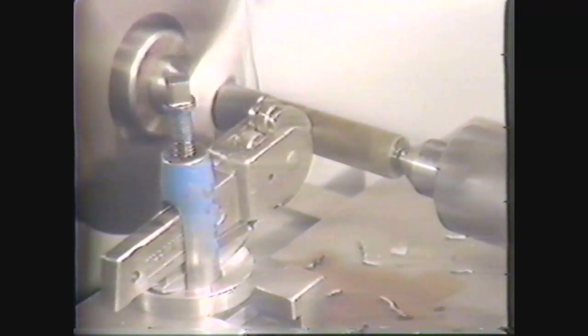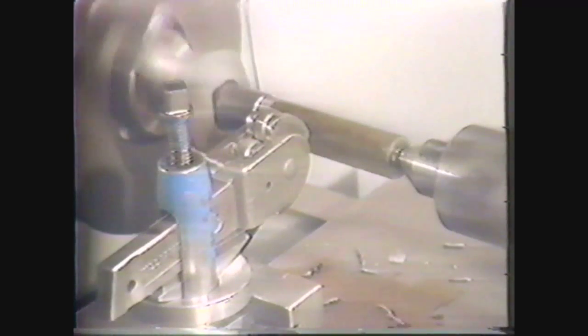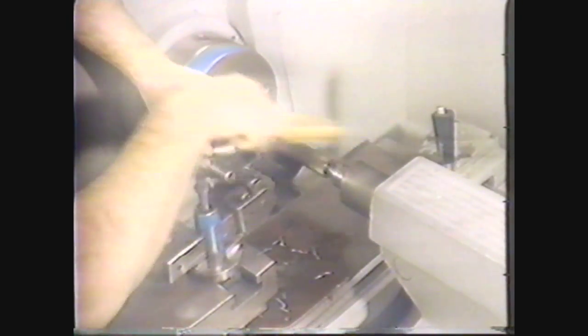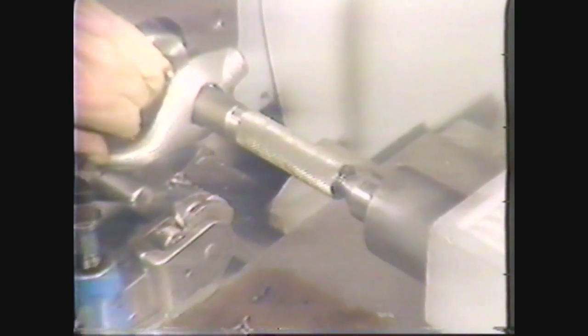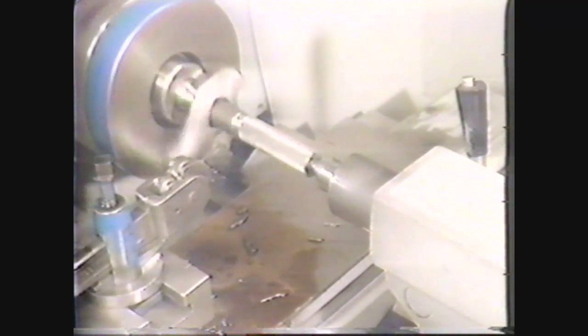At this point, you disengage the clutch to stop the workpiece, and then clean the impressions with a brush. The diamond-shaped knurls should have fairly sharp points across the entire surface. Here you see how a proper diamond-shaped knurl should look. When the knurling is completed, you will notice that the end of the workpiece is rough. Engage the clutch and use a small file to put a small radius on the edge. This gives a more finished look and prevents possible injury to your hand.